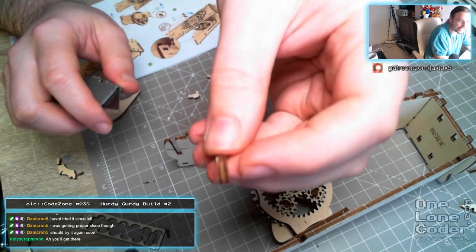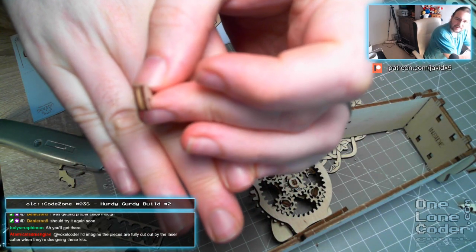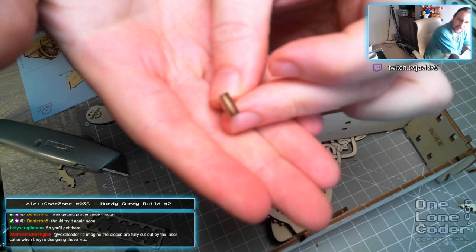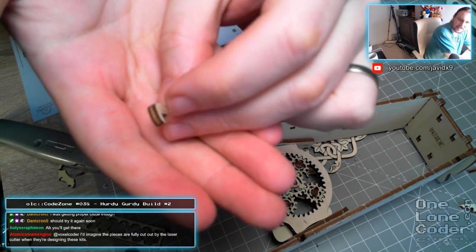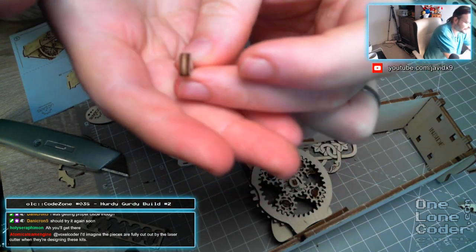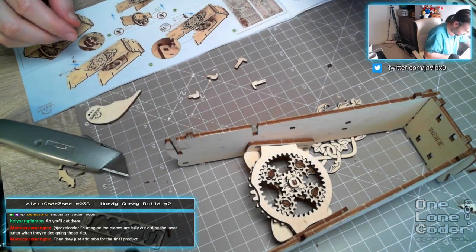I think you're always going to get that with laminated board. Come on, focus. Because it's plywood, it's made from very thin strips of wood, which is all laminated and glued together. If the glue is compromised along an edge somewhere, then it is going to split out.